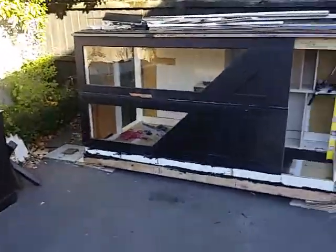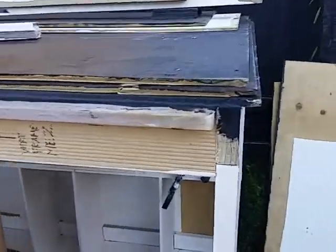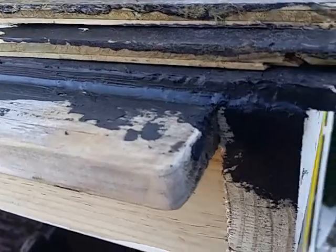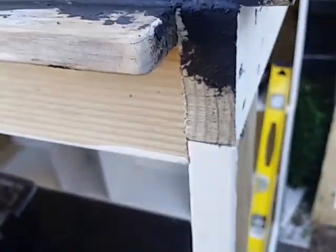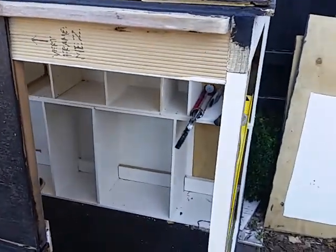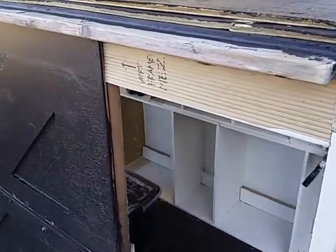Mate, this is a quick one. Haven't got much battery. This is where we're at. Roof's on. I've got a bunch of stuff stacked on top of it, so that's not very clear, but if I get up close here, you can see I've built eaves into this side. And that goopy looking thing is the line of silicone that seals the roof edge. It's also got silicone between the sheet and the frame, so it's glued on as well as screwed on.